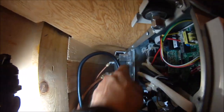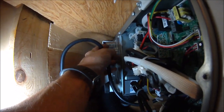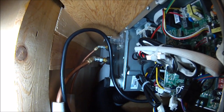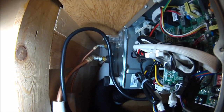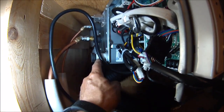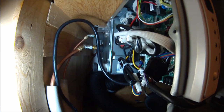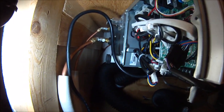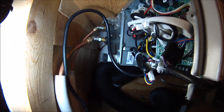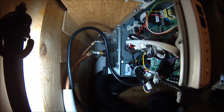There's a drain pump in here for the condensation pump, and you're supposed to just run this out and get it away from inside. The problem is when you're camping, sometimes you're not exactly level, especially in this bus you can't level it. So they provide these plugged fittings at the bottom of the plastic pan, the drip pan, and so what I'm going to do is connect all 3 of them, and that way if I'm going downhill or tilted to the left or tilted to the right, it ought to pick it up somewhere rather than running out. And it's a nice little pan in there. So we will do that after we finish this.